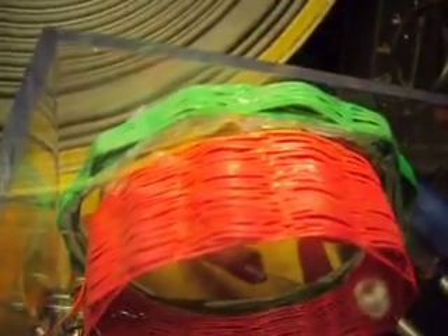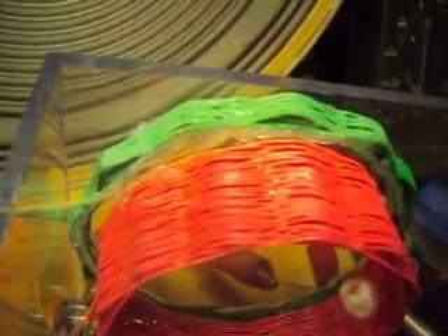There are 10 strands of 38 litz wire in these coils, and of course I got them painted. One was on a 3-inch 13-pin form and the second one is on about a 3 and 7/8-inch form. The green primary is about 17 turns of wire and the secondary is 50 turns, with a tap for the diode at about 17 turns.